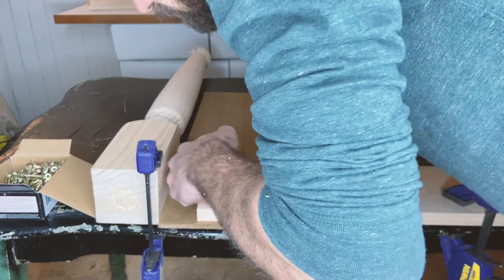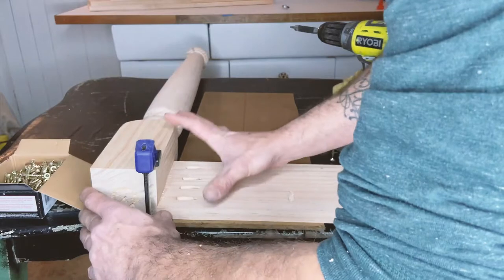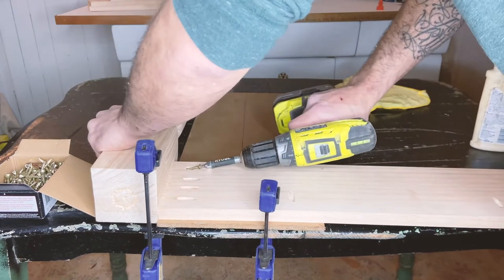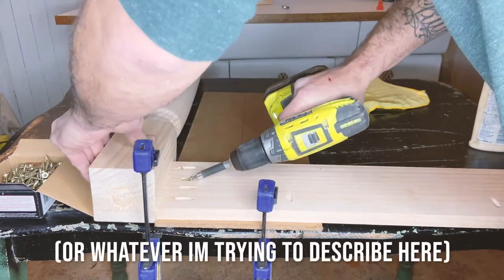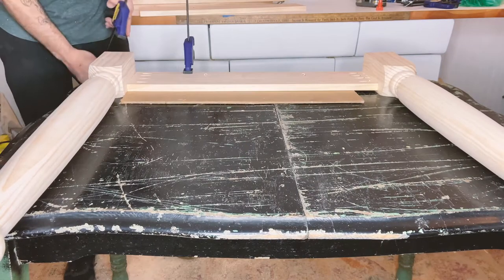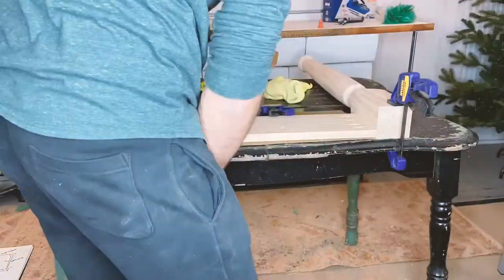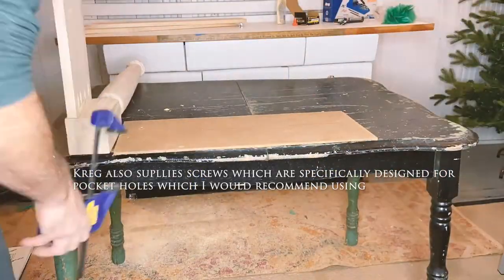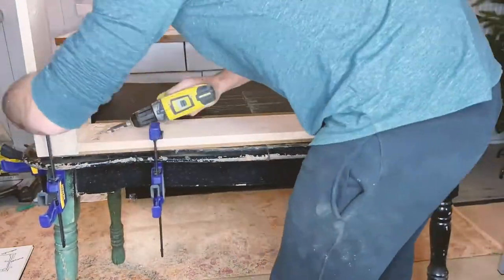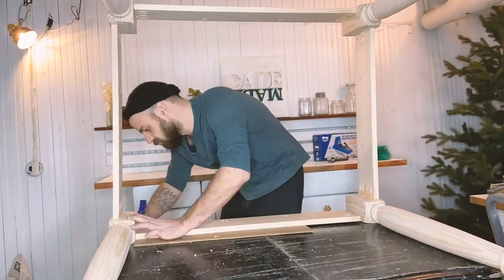To combine all the pieces, I applied wood glue to all my joints and then clamped down the butcher block leg and side panel pieces. I also put a quarter-inch piece of plywood underneath the side panel to create a quarter-inch depth change from the table leg to where it insets the side panels, which gave it a more refined look. One thing I discovered: if you put too much pressure with the screw into the pocket hole, it splits the wood — which will compromise the finished structure.